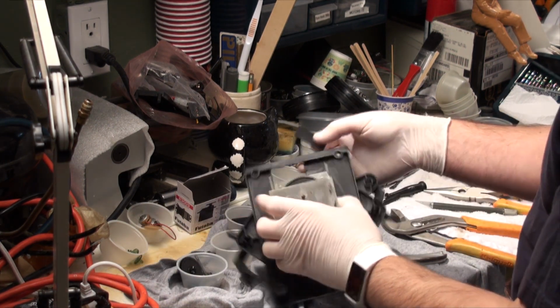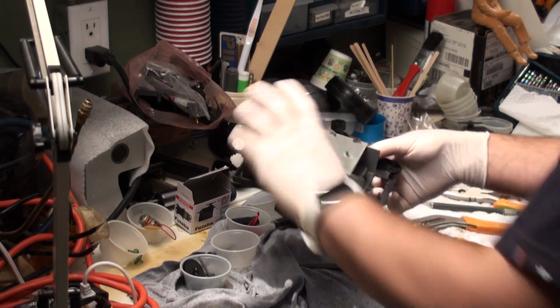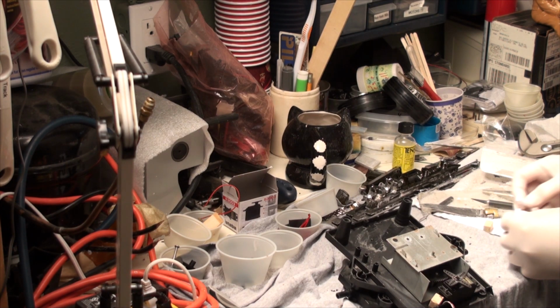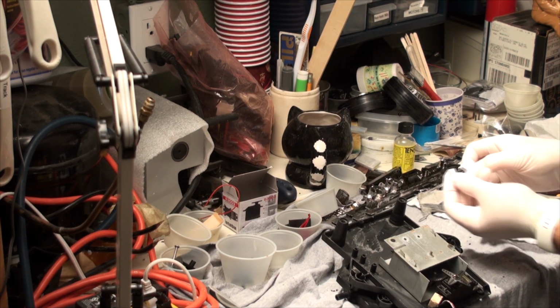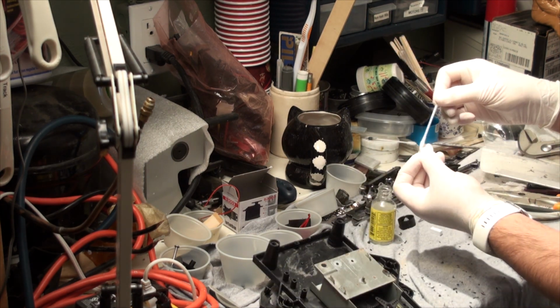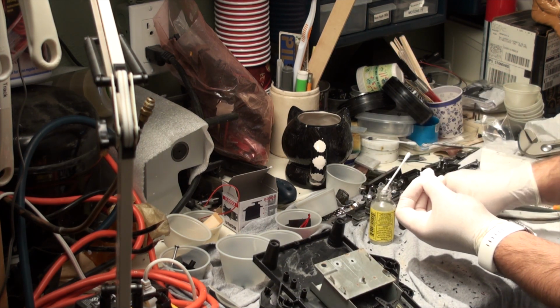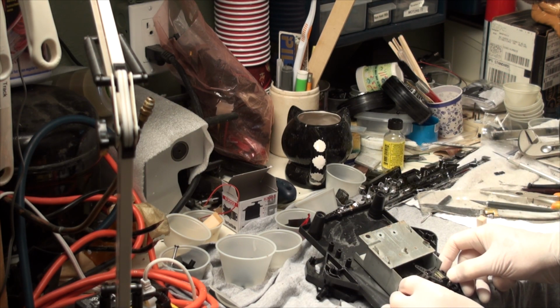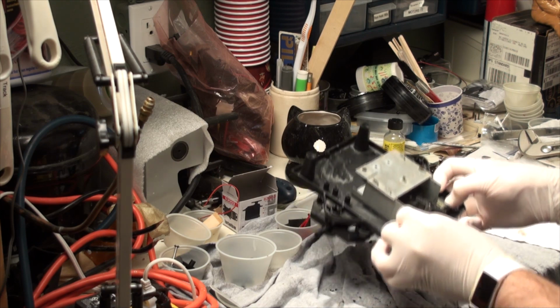Once the servo's mounting spot was completed, I had to create 2 attachment posts to secure the servo to the steering assembly. I used some square styrene stock, as it's easy to work with, and I had some on hand. The mounting blocks were fabricated and used to install the servo into the steering assembly. I can now test the servo before attaching it to the steering gear.